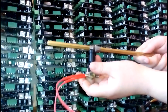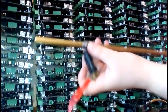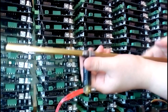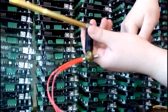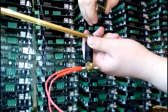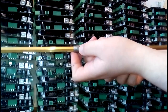The problem I had was, I wanted to use this system for dual extrusion, or triple extrusion — whatever — and then you have to have multiple shafts, or you have to have just one shaft but relays on each of the gears to push or pull the filament against the gear. The problem with that is relays are quite heavy too, so you lose part of your advantage.